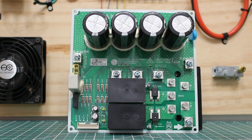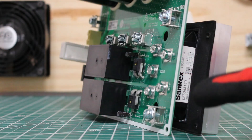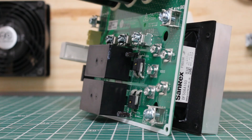For commercial LG HVAC systems, specifically the LG Multi-V line, you're going to find the bridge diode built into the converter board. This is the converter board itself, but specifically this area right here is our bridge diode. This piece itself is our bridge diode — if you take off the screws, you can remove it from the board, so you can replace the bridge diode without actually replacing the converter board itself.